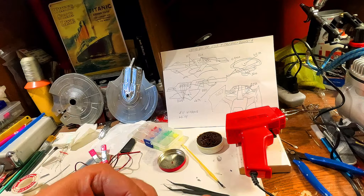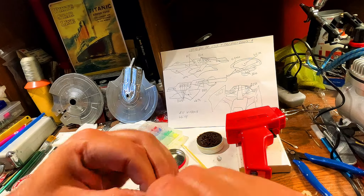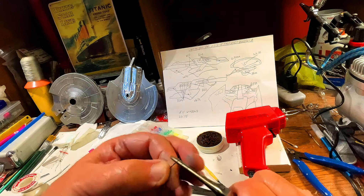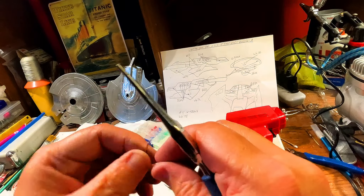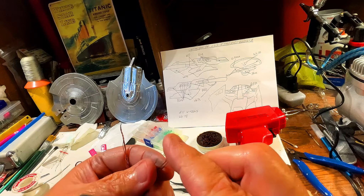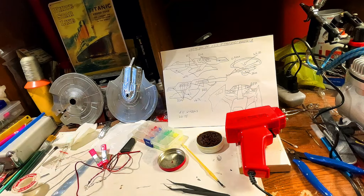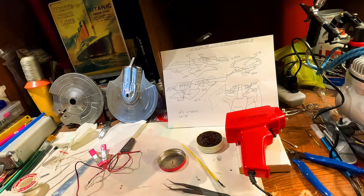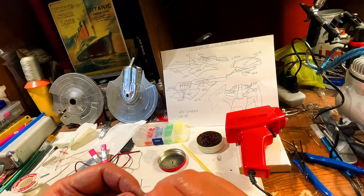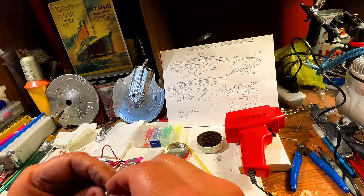Because there's not a whole lot of wire exposed on the bottom, you want to make sure you get all of them. Let's use the needle nose pliers to twist it a couple of times. We're going to do the same thing on this side — look at that, these will be all set. We're going to solder those into place with the five-millimeter LEDs. These are going to be really close together. Let's do the other leads — we're going to have one north, one south, one east, and one west. We've got to keep them where they're not touching.